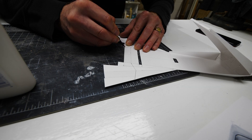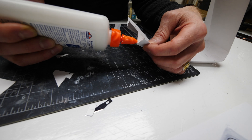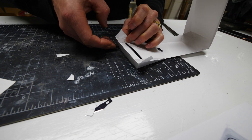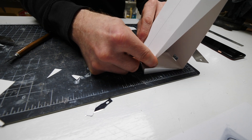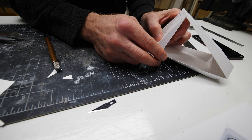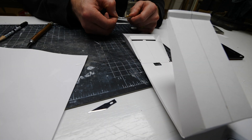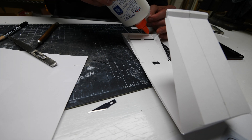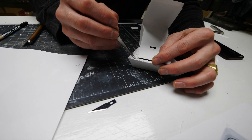You can see the slit where the top leg is going to slide in and support the phone. It's around this part that I come to the realization that I'm having some issues — the way this outrigger is designed gives me a bit of an undercut situation, or a draft angle situation, which is not going to work for production. I'm going to finish this model and then build another one to figure out how that's going to work. But I also need to work out this little detail where the phone is actually going to rest, so it sits on the charger at the correct angle.